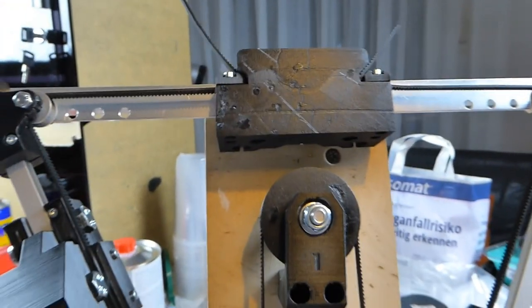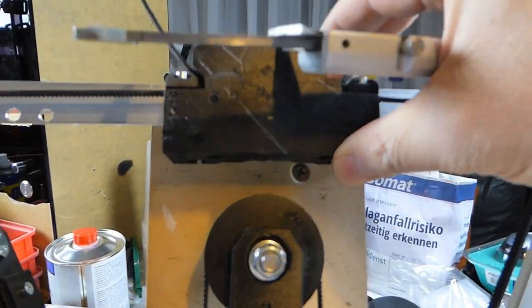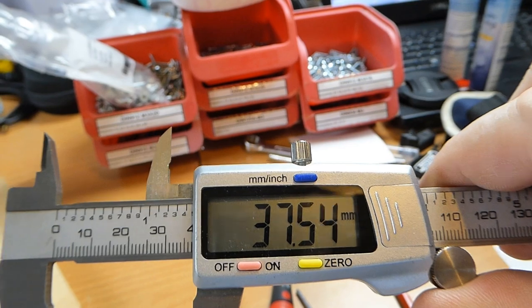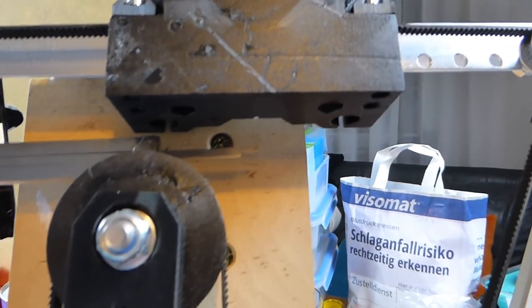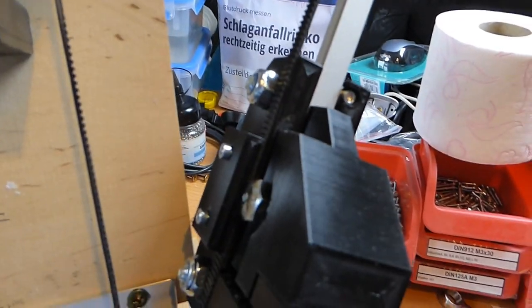And with the stroke being 75 millimeters and this plunger fully down, that means that this block should be out of center by half of that stroke length. So hold it next to the center marking on the plywood base, about there. It's not super critical. The stroke length should be enough to clear all the holes and everything. I can now tighten down both those clamping plates. So that's next.